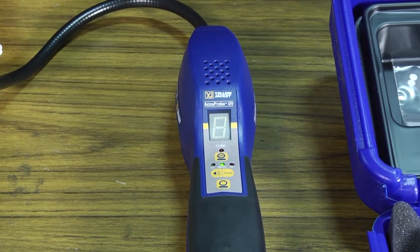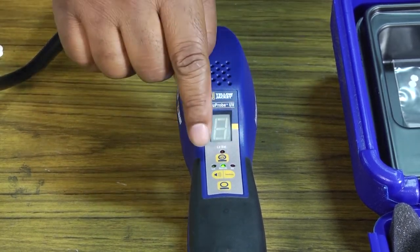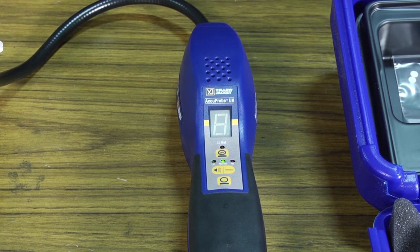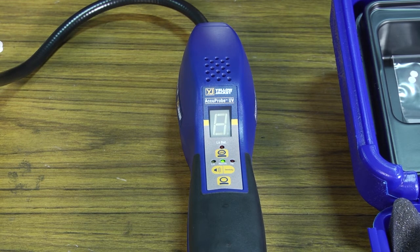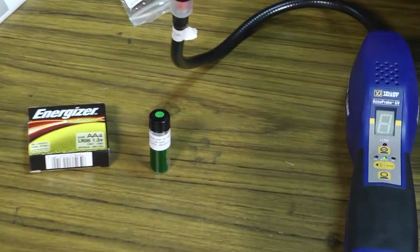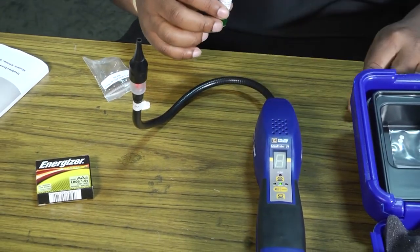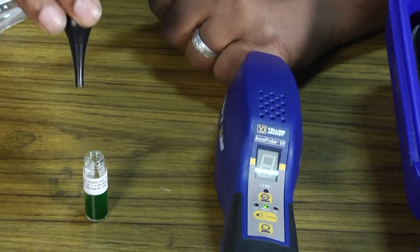You'll notice the instrument is running and the beeping has changed from the slow steady beep at the beginning. On our indicator LED lights, we are set to normal sensitivity. This leak detector can also pick up both R-22 and R-410A — whatever category of refrigerant it falls into, this leak detector is calibrated to detect both those types. We'll take out our test bottle. We have no numbers on the screen yet, so we'll open the test bottle, place it down, point the probe into it, and we should get a reading.